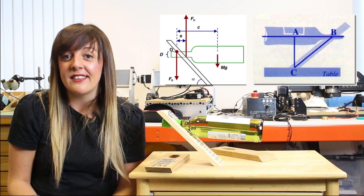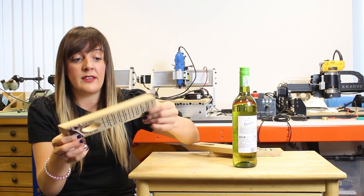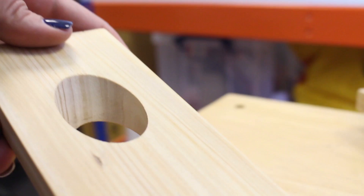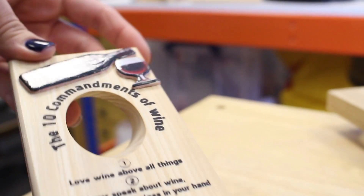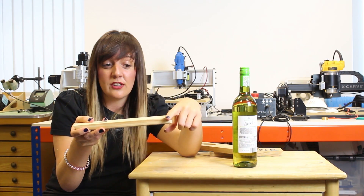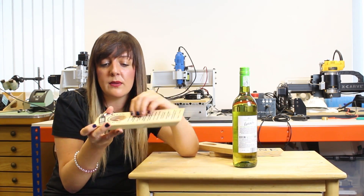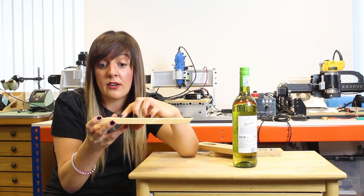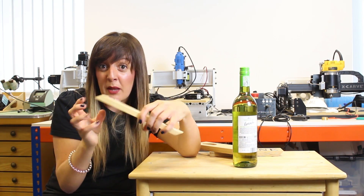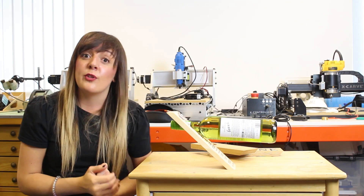I just thought this was a pretty cool thing to make, so I had to have a go at making my own. The original one I've based my inspiration from has a 45 degree angled base and also a 45 degree hole for the neck of the wine bottle to slot into. The base we can do very easily just using a 90 degree cutter. The hole, however, will prove a little bit tricky because we can't easily create angled cuts on our CNC, so I'm going to look at creating a basic hole based on oval shapes, which should provide the parallel stance for the wine bottle.